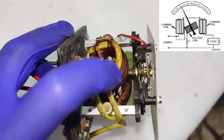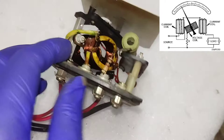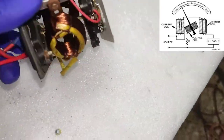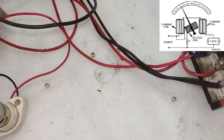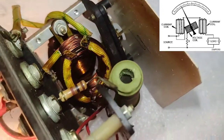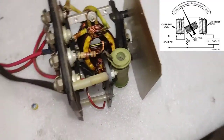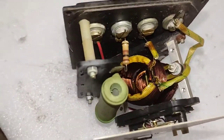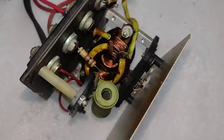M and L is a pair of coils connected in series with the AC mains — one winding on one side and the remaining going straight to the other. Whenever power is on, it first goes to the CT, and from the CT it goes to the resistors, meaning to the voltage coil. I'll put proper pictures on screen for better understanding. You can see when I turn it on, the coil is actually being moved. The voltage coil generates its own magnetic field because it is connected in parallel to the voltage — limited by those power resistors.